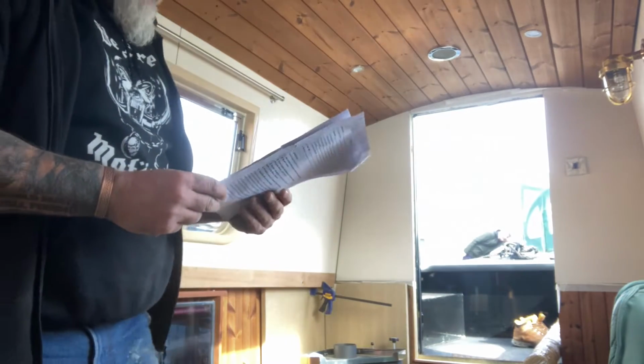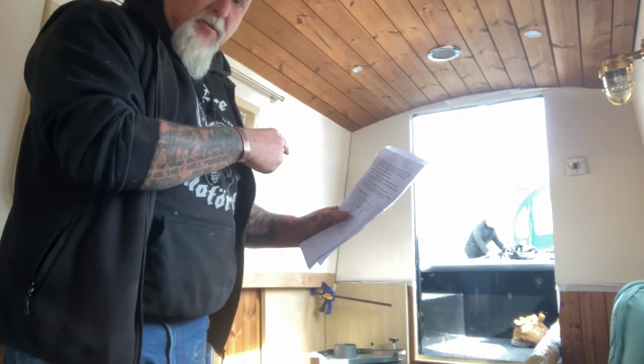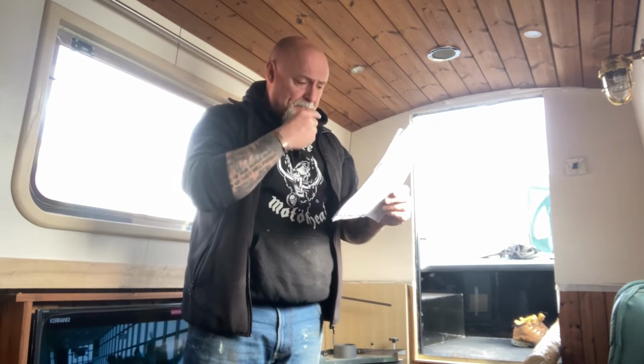So before that wood comes down, I want to line the fire up, the flue outlet for the fire, so I know where my exit point's going to be. Once the flange is all done, I will then cut the flue, because there's going to be a dog leg in it. Not much of one, but there is one, because Harworth strongly recommend that the flues do not enter the stove at an angle or the collar, so they need to be vertical. Obviously I can't cut the flue until I know where the flange is going to be.